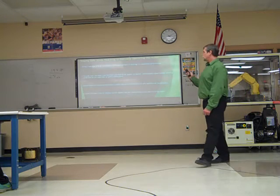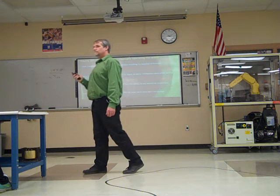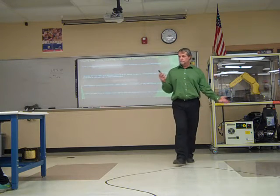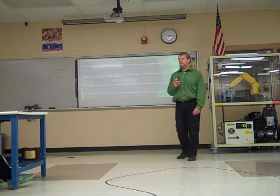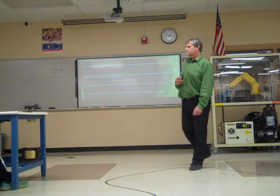Okay? So, things like watches, rings, necklaces, scarves, ties. You shouldn't wear them around that robot. Should be pretty obvious why. It could pull you with it. It's very unforgiving. If it gets a hold of you, it's just going to go about its business. It really doesn't care. It doesn't know.